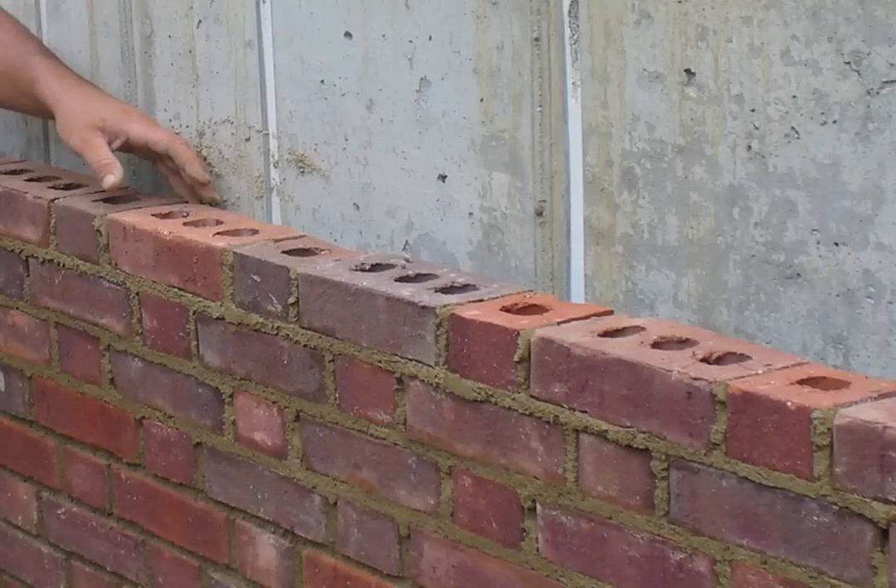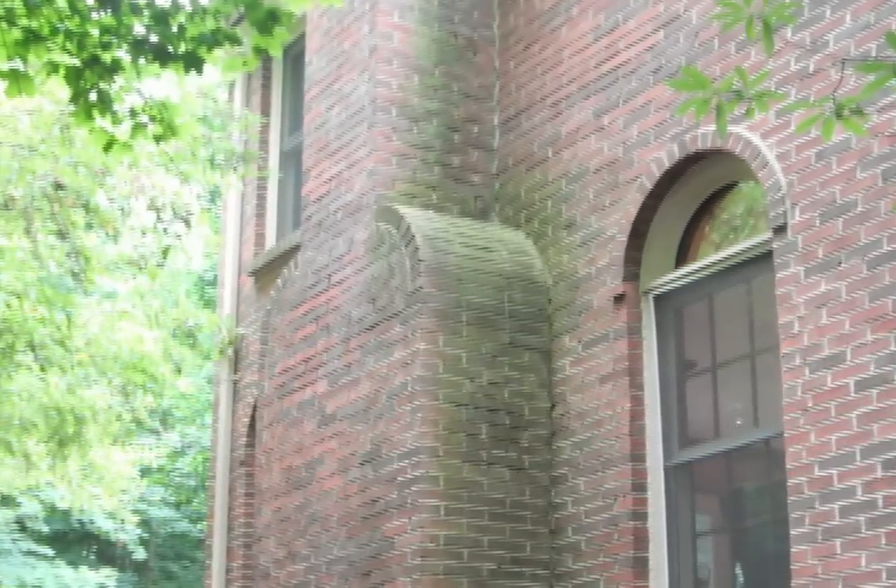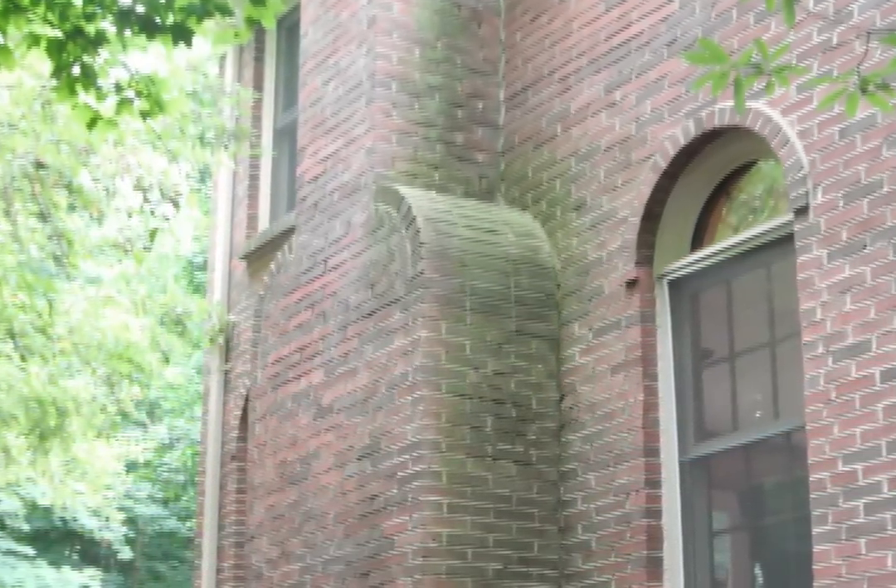When the chimney corbels are constructed with brick holes exposed like this, water will actually saturate through the brick and cause a water problem both on the outside of the chimney as well as in the firebox on the inside of the home. Green mold like this tends to grow wherever water can pool, and I think you will agree that this would look extremely unsightly if it were on your home.